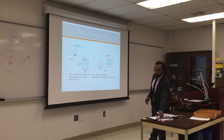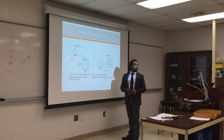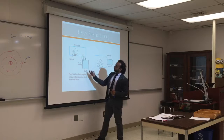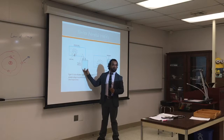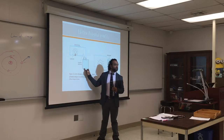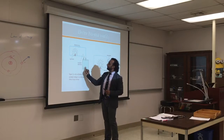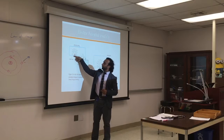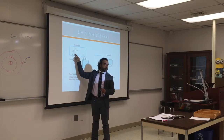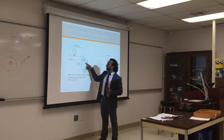Now we have to talk about circuits. A circuit is basically a complete path for the electricity to go through. So now we have a dry cell, which is a battery, right? And the battery usually produces what? AC or DC? DC. We didn't get to that yet, so if you do know, it's okay. So it's direct current, which means the current will flow in the same direction the whole time. It's going to be negative the whole time. The current will go through the light bulb, get used a little bit, lose some of its potential, and come back to the positive terminal.